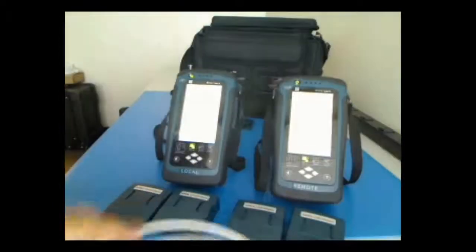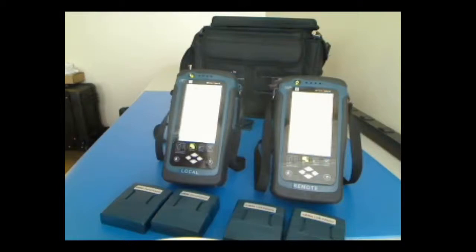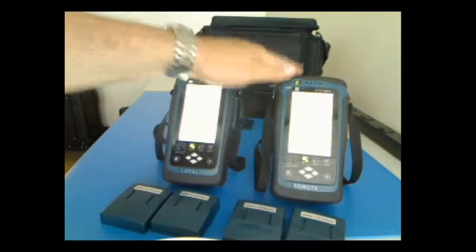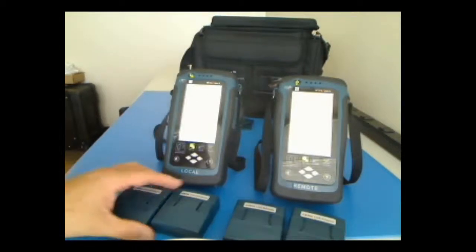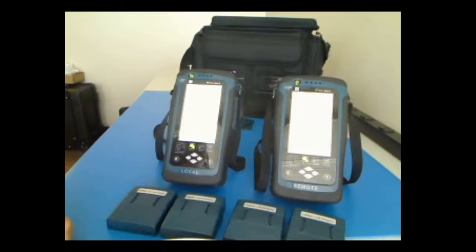This is another one. So what we're going to do first is set up a permanent link test so that we can check probably what you do a lot of, a permanent link. First thing we need to do is what we call a set reference. To do that, I'm going to walk through here the hardware requirements, what we have to do with these units to set up a permanent link. My next video will show how to actually do it and set up the screens to do the permanent link test. To do a set reference, which is critical to making sure your tests are accurate, you have to set the reference before you start.